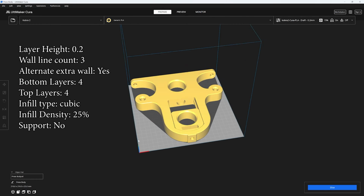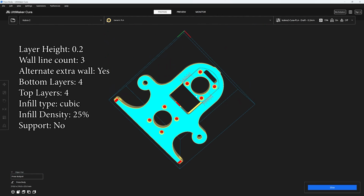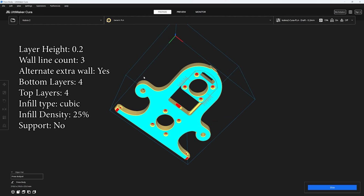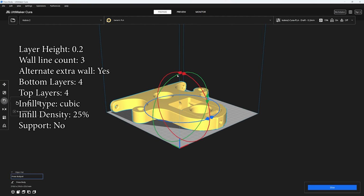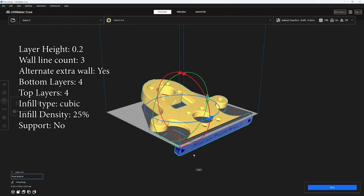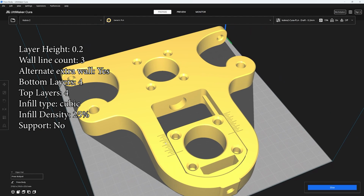Next up is the press body. I have mine oriented like this because I actually like the texture of the printing plate, so I have the outside facing the bottom. I also have these little pressure markers to let you know how much pressure you're exerting. Make sure your Z offset is really dialed in, because if it's too close, it's just going to squish all of those out. On the other side, if you want to make sure those print nice and crisp and you don't care about the outside texture, you can just flip this model over. Neither way prints better than the other, and you don't need support for either of them. Go ahead and print off 2 of these.